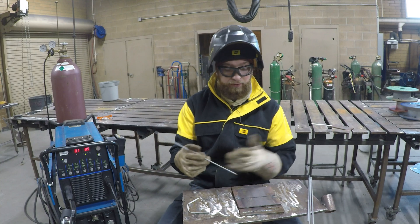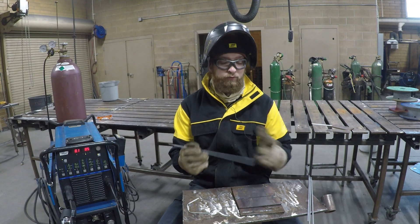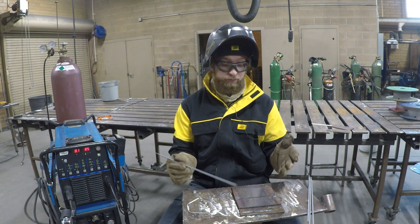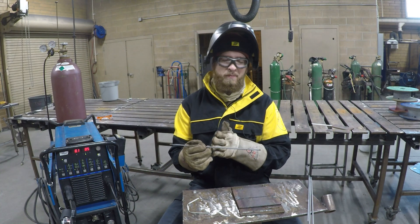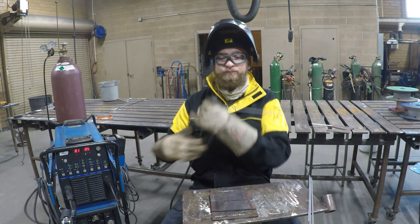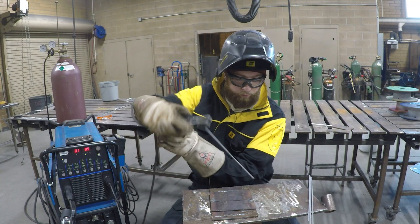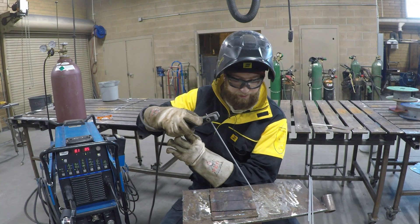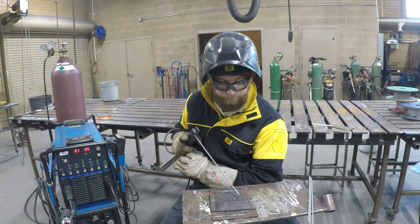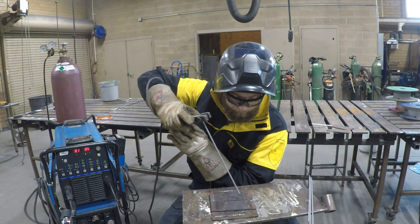We're going to repeat this motion all the way down. We'll go so quick that we may only use somewhere between a half or two-thirds of an electrode for a whole six-inch weld — different from 7018 where we used a full electrode for a six-inch weld. The angle is pretty important too. We want to maintain a straight-in angle — not angled left or right — with a little bit of a drag angle going in line with the joint. This will not work if you're lazily pointing it down the wrong way. You need to get that elbow up in the air and do this nice quick motion to push that puddle down.